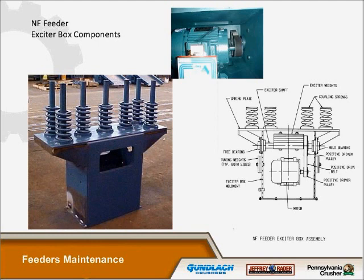Looking into the NF feeder box components, you'll see the motor, the motor shaft, and the driver shaft. The four points of contact are on either side of the sprockets — you can take a straight edge or ruler and confirm that it contacts at four spots across the face of the flanges. In the exciter box components, you'll see springs with rods coming out of them. When you go to change these springs, you have to take the motor out of the exciter box to get access to the bolts holding those connecting rods together.